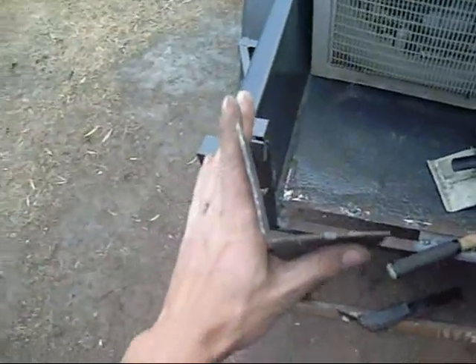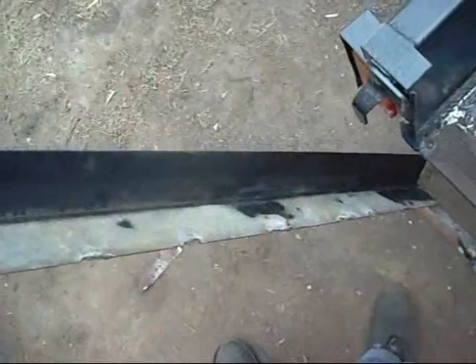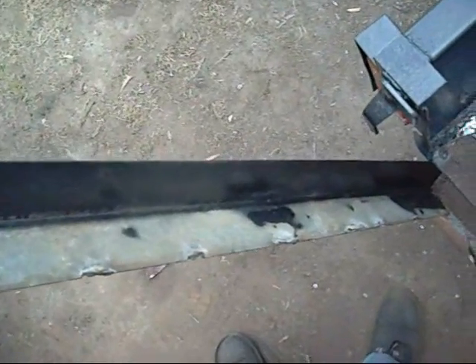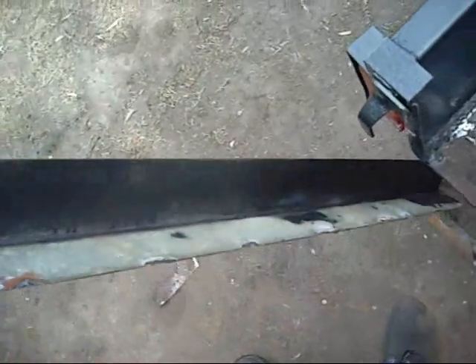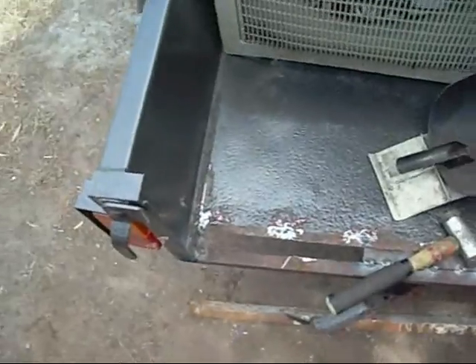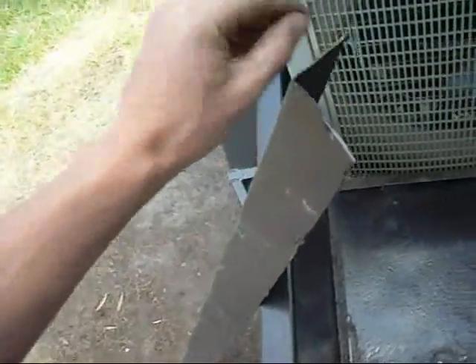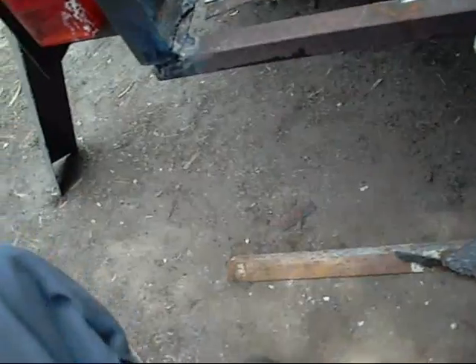This thing welded over the top of it — it's not even 45 degrees. Whoever operated that folding machine was a little bit off, not a right angle. Unfortunately I don't have a bender myself so I can't bend it back to 45, but I'll find some way of making it work. If anything I'll just run the grinder down it, cut the leg off, weld it on flush along here, and then weld my hinges onto it.